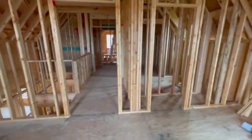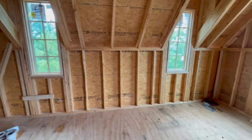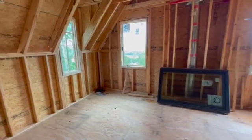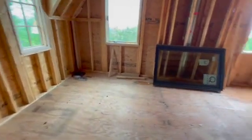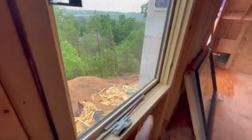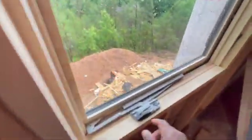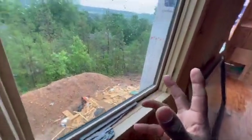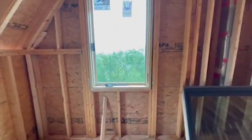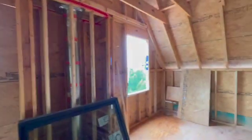You have to hold money back — that's the only thing you can do. Hold money back just to make sure they finish up. You're not going to just not pay them though — a guy should be paid. But this is an example: when you install windows, you don't want to just put them in. You need to make sure the windows are closed and locked before you put them in, because now we can't close it. So that means the window is not quite square in this opening and they've got to come back and get that right.